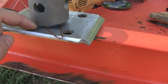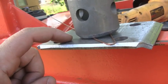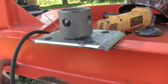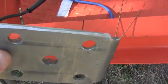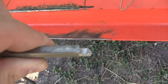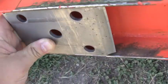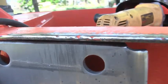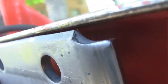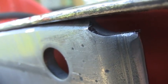That's what a bevel is for - so that it melts the bottom and that pipe piece completely together. If you get it right, when the stick's in there, you hear a sound where it's making a little hole and just piercing to the other side. You can see sparks coming through the middle of the pipe if you're doing it right. I'm beveling that piece too - first I ground it so it'll fit, then I bevel it so I can stick my stick rod in that groove and make it really penetrate, go through the back a little bit. That's what beveling is.